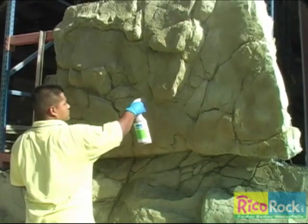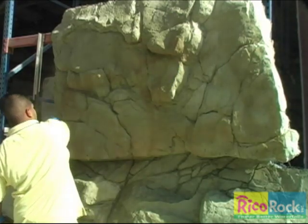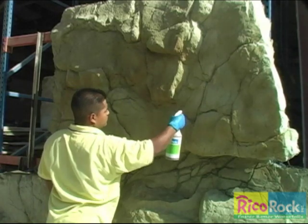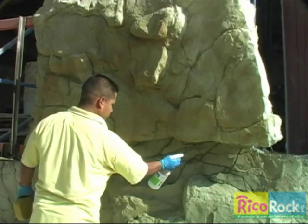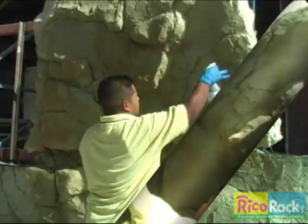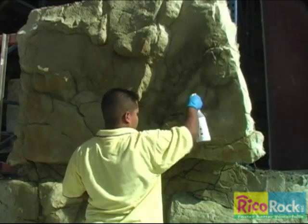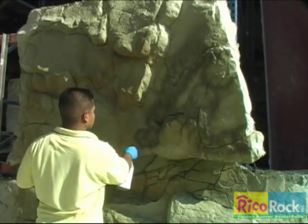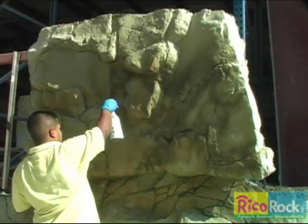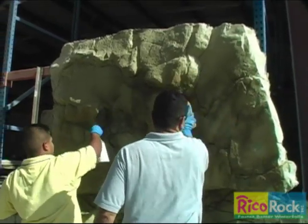Some dealers use chemical stains or mix paint tints with our acrylic stain to create unique colors or more intense color. Speckles of off-white and black can create a salt-and-pepper granite look, but that tends to camouflage the rock texture. A good color job brings out the character of the castings. Coloring is the best time to blend hand-textured areas into the castings. It helps if the mortar used in the hand-textured areas is the same base color as the castings. Grieco Rock has rainbow cement for this purpose. Hand-textured areas might soak up more stain than the castings, but they will color the same if the base color is similar.